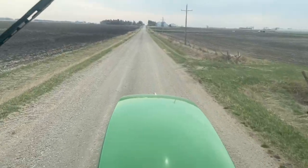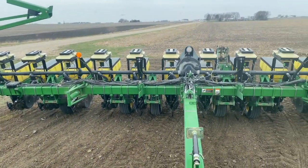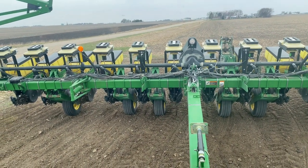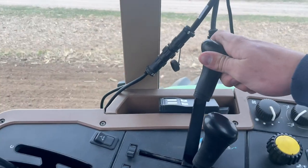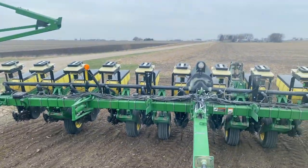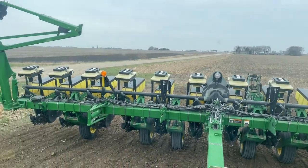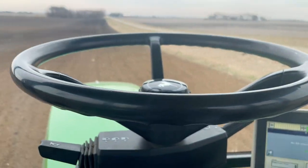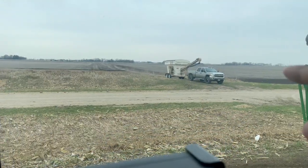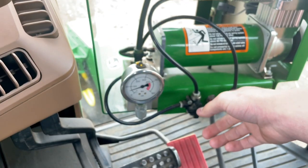Let's start this bad girl up. I got it unfolded — go ahead and lift it up, pull it for a little bit so all the cylinders get even, then we can start the vacuum. That gauge right there should show pressure. I want it set to about 14 for this kind of seed because it's fairly light. When I plant that other stuff I gotta turn it up to 18 because that's 10 pounds heavier. I'm gonna purge the planter and then we can start planting. I gotta turn on my downforce a little bit here.